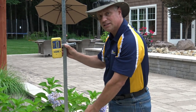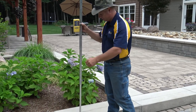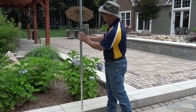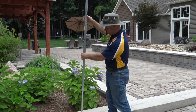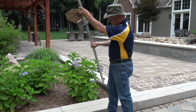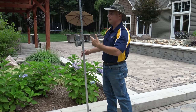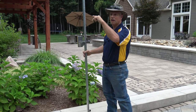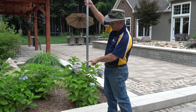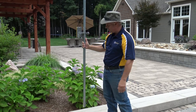This has an internal foot in it, which allows me to set any point on my job site to zero elevation. On the other side of this laser rod, we created it with zero either at the top, or I can reverse the pole where zero is at the bottom. So it's really handy if I've got a raised ranch where I need a lot of elevation figuring out step treads and so forth. I can get my laser reading at zero at the bottom and graduate down my 6, 12, 18 inches and so on.